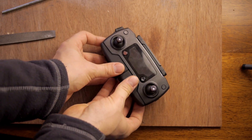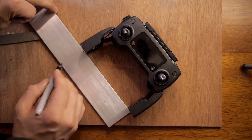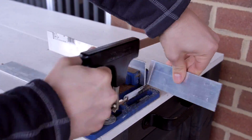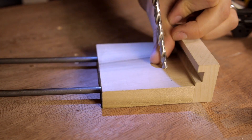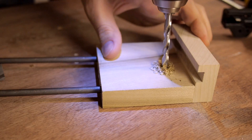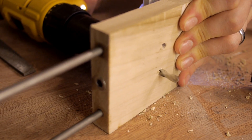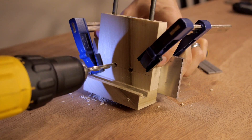The entire clamp is going to be put into the bottom of the Mavic controller where you would typically clamp a phone, so I just created some aluminum pieces to fit inside of that clamping mechanism. Then you need to mount this to the clamp itself. I drilled a couple holes through the big poplar piece and then transferred these onto the aluminum by clamping the aluminum to it.